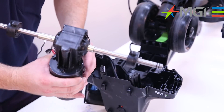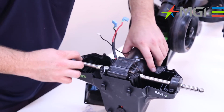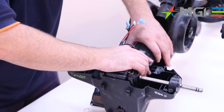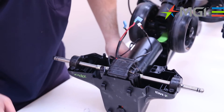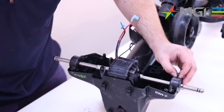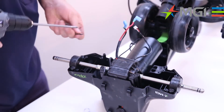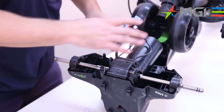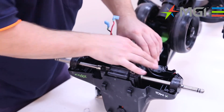Now that it's back together, you can put the motor and gearbox back into its position. When you're putting it all back together, just make sure that all the cables are tucked away nicely — you don't want to pinch any of the cables from the motor controller. So now that it's all back into position, we want to start by fastening the bearings back into the housing. We'll start off with the outer bearings on the gearbox, followed by the brace. We'll put the brace over the motor with the four screws.